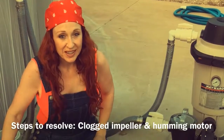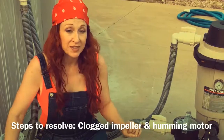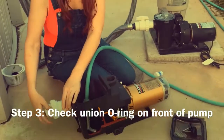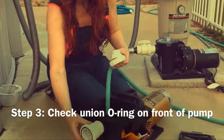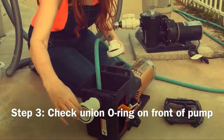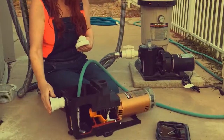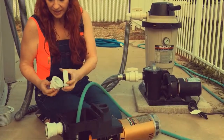Third and fourth things to check — now that you've checked your water level and made sure that's good, and replaced your pump lid o-ring if necessary, let's move on to checking the union at the front of your pump. A lot of unions will have an o-ring in between the two halves — you can see an o-ring right here. That o-ring might be bad as well, so that's a replaceable piece. Just bring that into your favorite pool store and get your o-ring. Check and make sure you're not getting any air in that area.